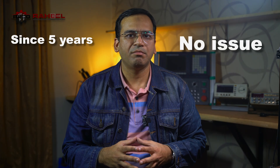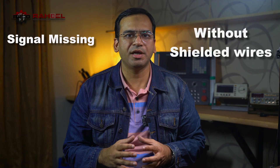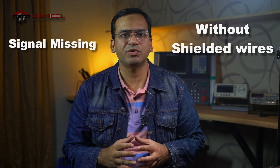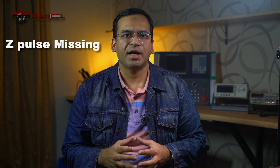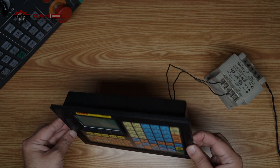I have been using this controller for 5 years and have not seen any major undesirable behavior. However, when using an electric tool turret, it can miss high-speed input signals if you are not using shielded wires. It also misses the Z-pulse input signal during homing at high speed. Overall, it is a good, small, budget CNC controller.